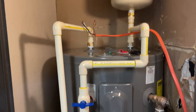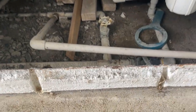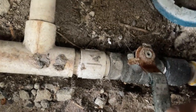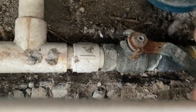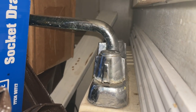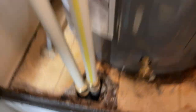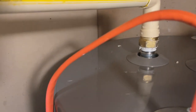That's where we're at so far: cold is sucked up, the shutoff is down, got the relief going down underneath the home, a little extra hot pipe tied in — we just have to do the electrical and let the glue dry. Glue has set up and everything's ready to go. Time to turn the water back on to the house and fill that water heater. There's been something good so far — I don't see any leaks. You can hear air bleeding out from the hot side on the mop sink. She's full — no leaks where we adapted anything, nothing going on at the shark bites. Everything looks good; we're going to get the power turned on and wrap this up.